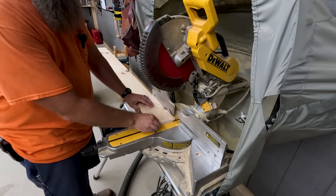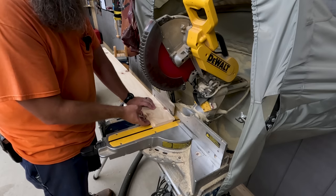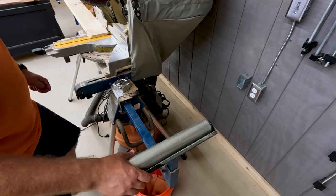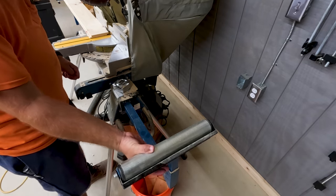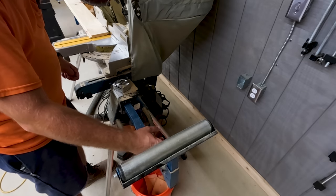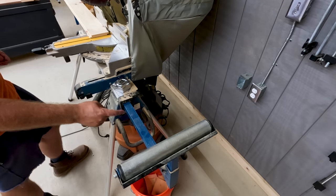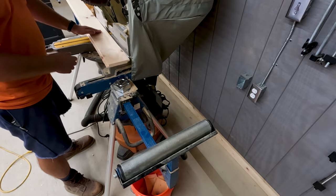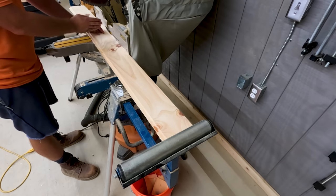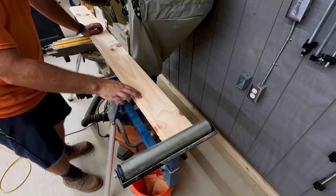Anyway, you make your fresh cut because you want a nice straight edge. Then here's the trick: pull out this little arm and bring up this roller so the rollers aren't going to hit the board. Instead, the post that holds up the roller will hit the board, and you set your measurement — 38 and three quarters. Make your cut, slide it over, it hits that post, and every time you'll have the same length on all your cuts.